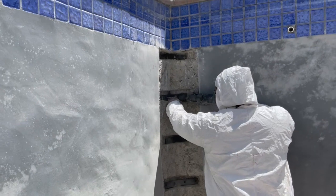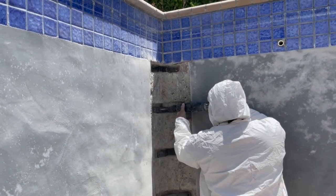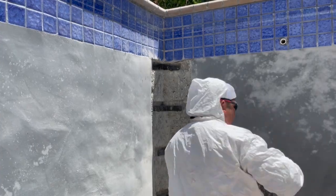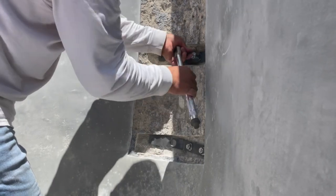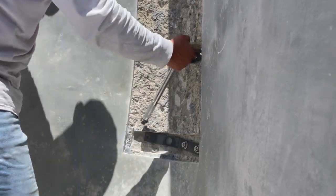Here's where we drill it out. We use our Bosch Bulldog with a half-inch masonry bit and drill all of our holes to get it ready so we can put our staples in. Now that we've set our staples back in, we use the bolts that they come with. We're not torquing these — just tightening all of our bolts, getting them hand tight and nice and snug.